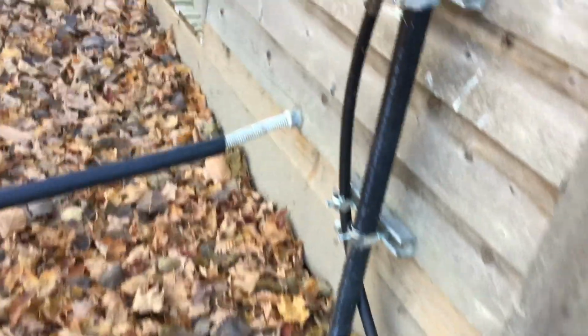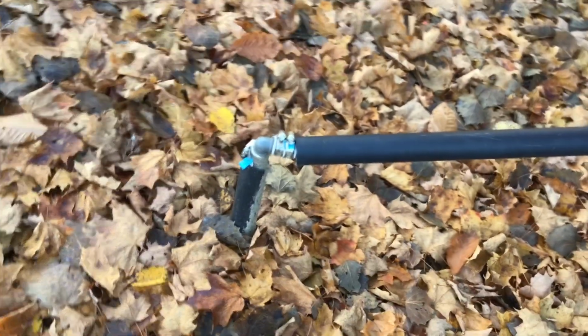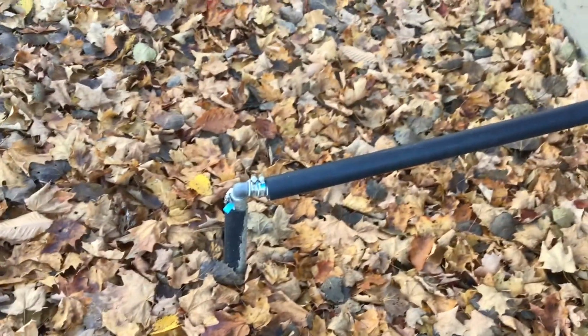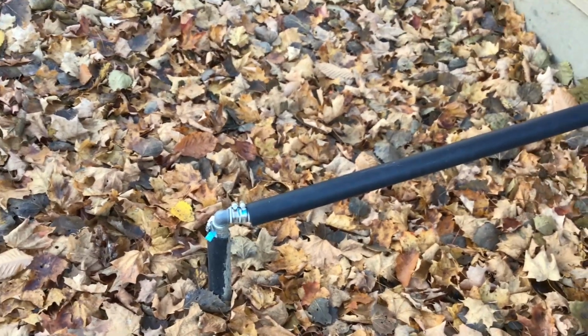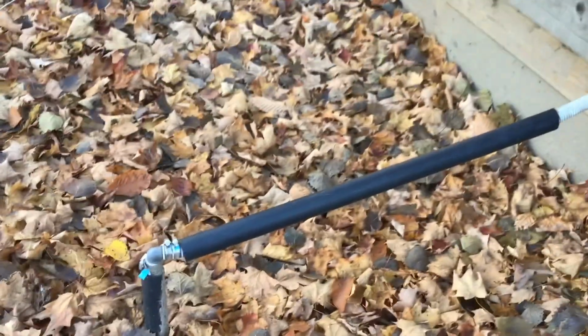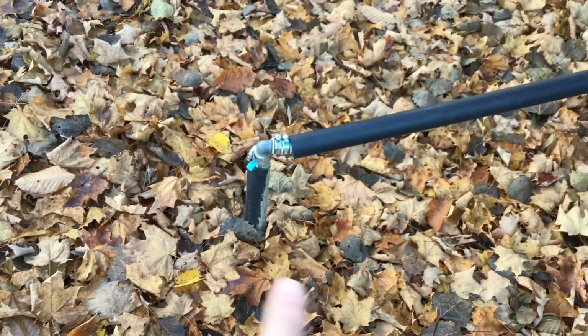Here's the hose. It comes out of the wall. It's clear, flexible. And what we did was, I wanted to be able to check to make sure it wasn't plugged, because the worst thing that can happen would be if it got clogged or plugged, or if you had, let's just say, a Separett. That's a kind of toilet where the urine is separated and goes outside, similar to this. If you don't bury the end of the hose, a mouse could crawl in there or dirt could get in and clog it. So we put plastic pipe in the ground, and then we put the flexible hose, which my husband cut and put an elbow joint on. And so we can pull this out anytime and check to make sure it's not plugged.